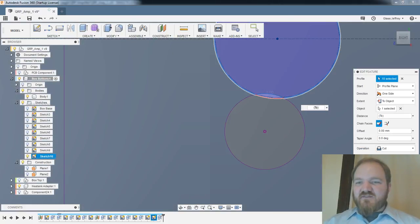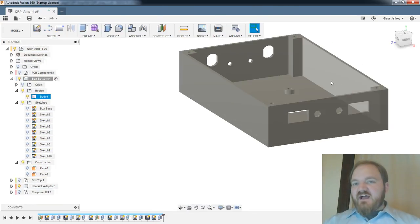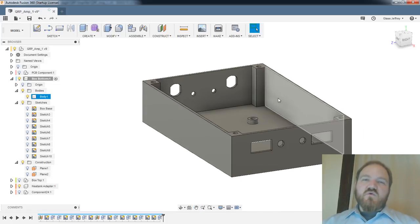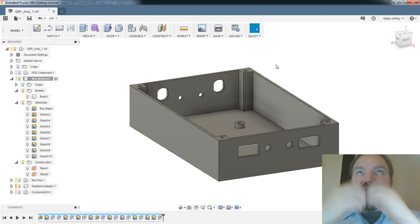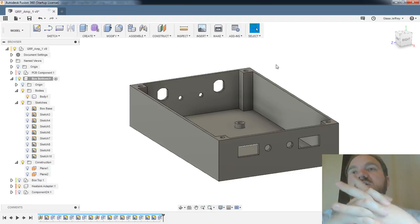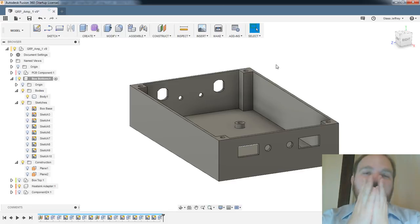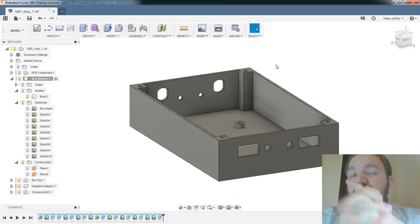Let's unbone that. Yeah. Okay, I think this is... What's your go-to for that value? So on my printer, if I have a non-3D printed part that's fitting into an interior hole, like a piece of brass rod that's going into a hole, I will do 0.3 millimeters all the way around for an okay fit. For a tight fit, I'll do 0.2, or 0.15, and know I have to file back a little bit.